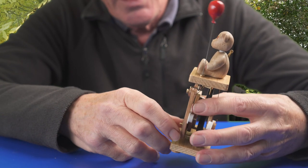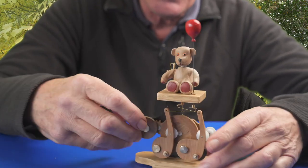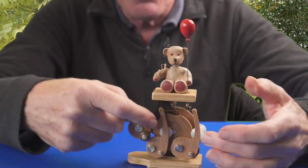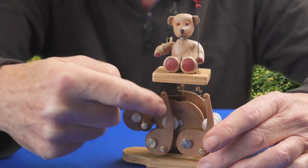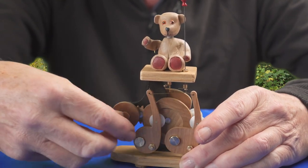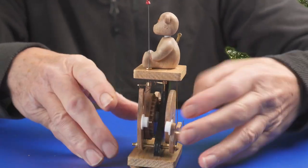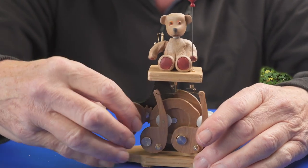A particular note is that it has an open frame. It also has three cam followers but only two cams, because the front one has two cam followers working on one cam wheel — the cam wheel has an internal surface and an external one, so you get two actions for the price of one. The one thing about open frames: they look nice and you can see all the parts, but it's very difficult to stack a lot of cams together.